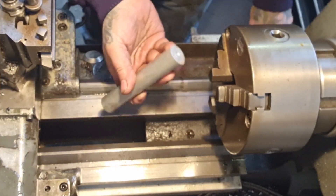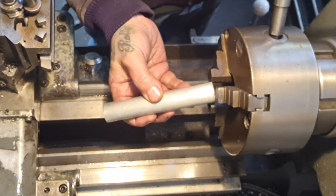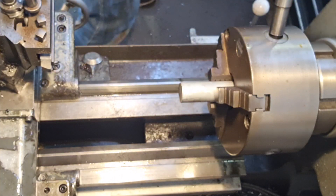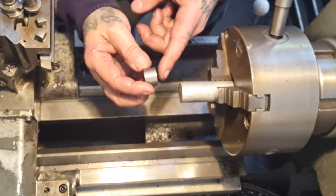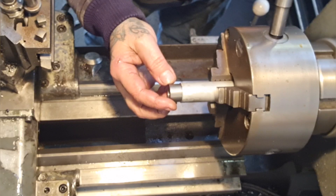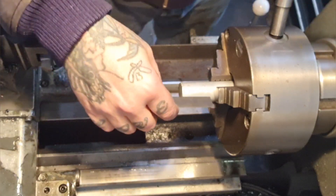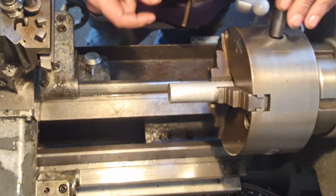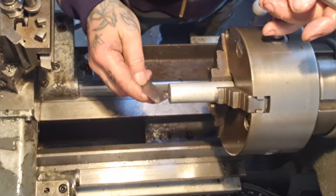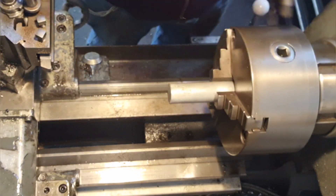Come on to the toe pegs now. We've got this inch billet - I'm going to turn it down to 23mm, same as the mounting bosses. They go on the end of the blade, and then these go on the end of that and then you've got your toe bit. We need 50mm length, so we need more than 50mm sticking out - 55mm. We need an M8 hole, 23mm diameter, and we need to put some ribs in it so the feet don't slip off.